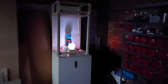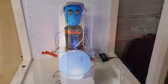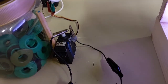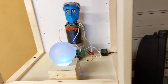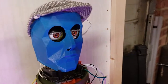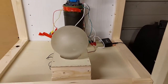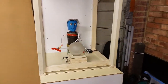The coin switch can't power both micro:bits at once, so I can't trigger both with it directly. What I do is get the first micro:bit to handle the cycling of the blinking eyes, and then the first micro:bit runs a servo motor. After the blinking eyes cycle, it activates another servo that crudely simulates a button press, and that activates the second micro:bit, which triggers the random colour change in the crystal ball.